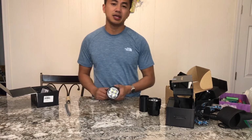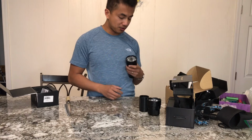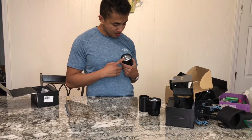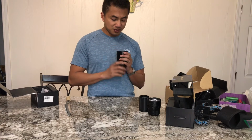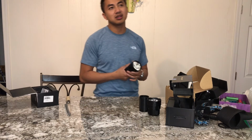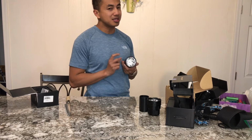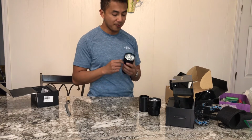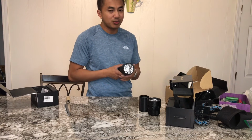I guess it's because here's one mistake that most of these multi-reflector lights make. They make the reflector way too damn deep, okay? And too small in diameter to cramp a lot of LEDs. I guess the effort is to add more surface area to reflect light, but depth doesn't really do much. Depth just puts a lot of lumen in the corona, not in the hotspot. You need a lot of width to put lumen into the hotspot, and that's what really makes throw.